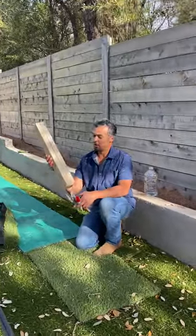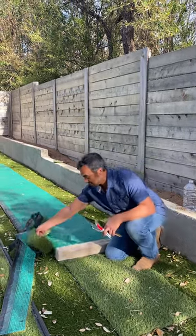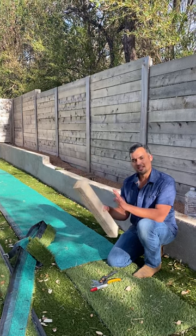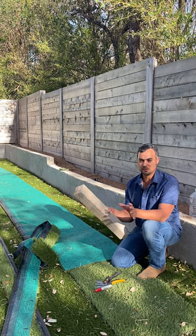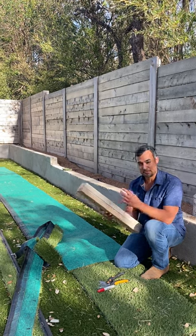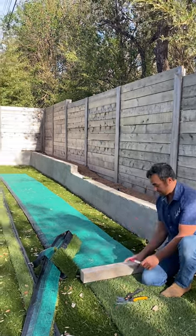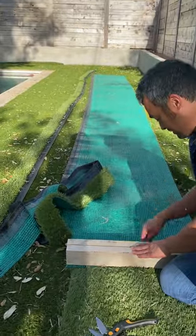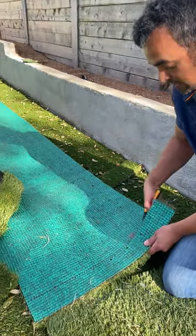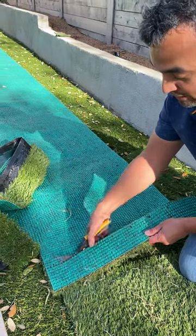I made a little jig because our turf width was two two-by-fours, so it's easy to cut your strips. One important thing: measure each strip individually, because when you make the pavers yourself some gaps are exactly two two-by-fours and some are slightly larger. I measured that one over there and it's just slightly larger, so I mark it and use the shears to cut along the line. Cut your strips just a little bit longer than the length so you can get really precise when seaming them together.